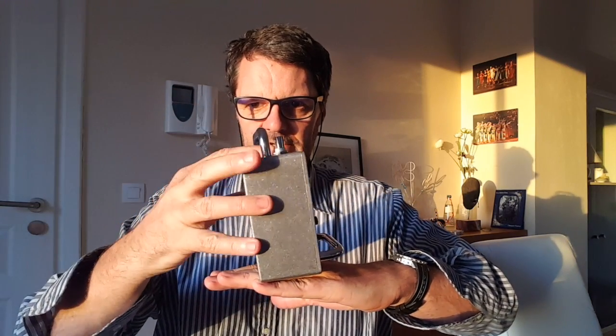Note that something really useful to have is a drill press, because it's practically impossible to make a straight hole with a hand drill. Now, don't make holes the way I do it sometimes, because it's not good. Sometimes I have to hold the case, because the case walls here are not straight, there is a bit of an angle here. So when you drill, first of all, the case is at an angle when it's resting, and then you drill and this is at an angle as well, so everything is crooked. So sometimes I just hold the case a bit like this and I drill, but that's not the way to do it, but it works somewhat.